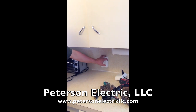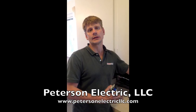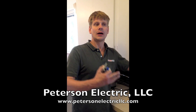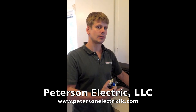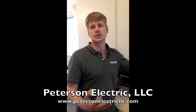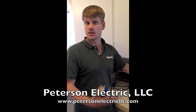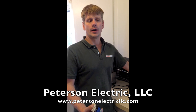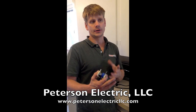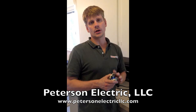This gets a little costly — it can be about $30 — and keep in mind, this is the more inexpensive way of doing it than rewiring the whole house. The code does not allow you to run grounds separate from the box if you're trying to get it passed through your city with a permit. I have done it in the past with wire mold, and it does work on the outlets, and it will pass for your rental housing inspections like Boulder and Fort Collins. But for Denver, as far as under their building permit, it wouldn't cover.